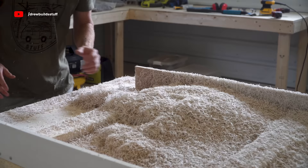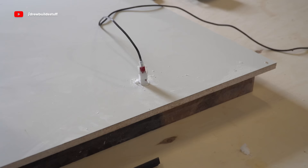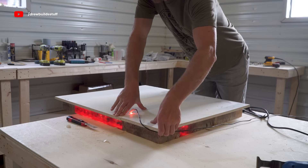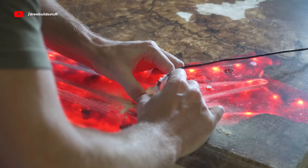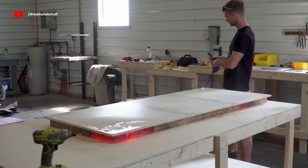After pretty much a full day of doing one of the messiest jobs I have ever done, the end result looks pretty good — it just needs a good belt sanding. First I'm going to remove that backing board of the mold that's still stuck to the piece. I used my oscillating multi-tool to cut around the light input, and then the backing sheet popped off pretty easily thanks to that mold release. Then I just carefully cut in towards that original hole trying not to cut through the light and ruin the piece, and that worked out a lot better than I thought it would because there's really no information out there on casting LED lights in epoxy.